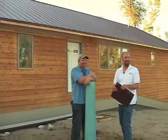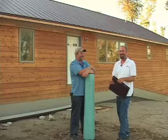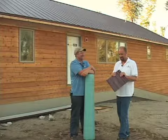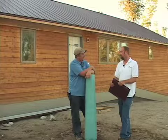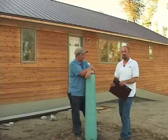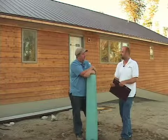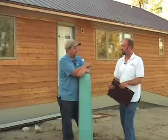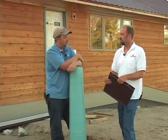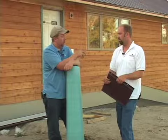Look, there's a deer — yeah, we're out in the woods. So even three-foot-wide steel, we've seen a lot of that go on homes lately. That is not standing seam, but it does have screwed fasteners. That particular style of ribbed steel is very comparable in price to shingles nowadays, all depending on the roof style. It almost beats them.